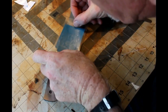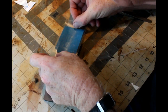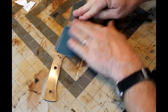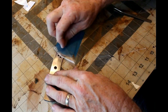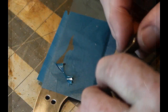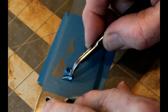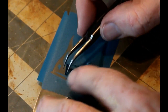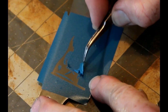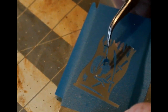You really have one shot at this. You line it up with your registration marks, just place it down, and then use the same credit card to make sure that the vinyl is really adhered nicely to the steel. Remove the transfer film, and then the next step is to weed that vinyl — remove any areas that you want to get etched. The vinyl that remains will end up being shiny on the finished piece. I like to use 90-degree tweezers; they make it easier to grab the vinyl and pull it off. You can also use a little razor knife to get the vinyl started.